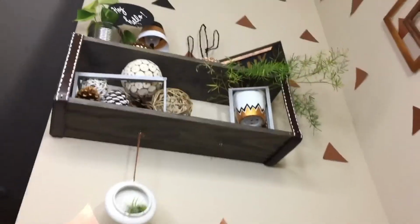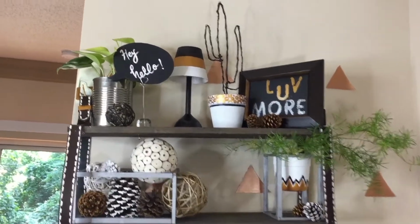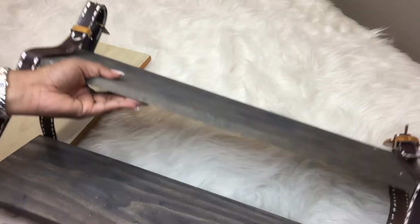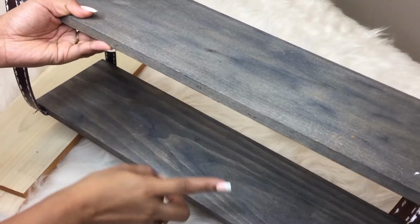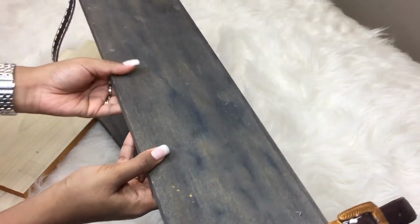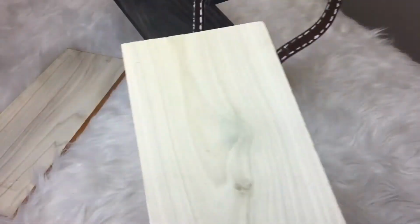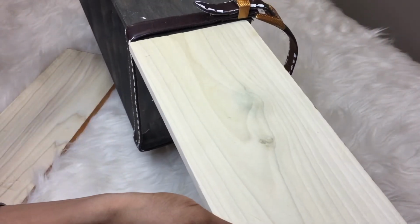First one, you will need 1 or 2 planks of wood or ply depending on the measurement as per your requirement. This one is supposed to be a single plank of 36 inches length, 6 inches width and thickness of half an inch. You could simply divide one such plank into 2 equal pieces that would be 18 inches in length and use them straight away.